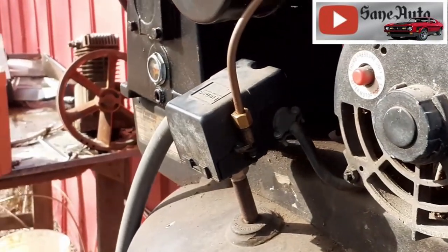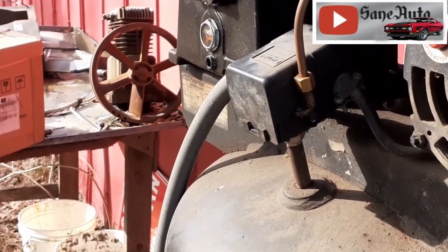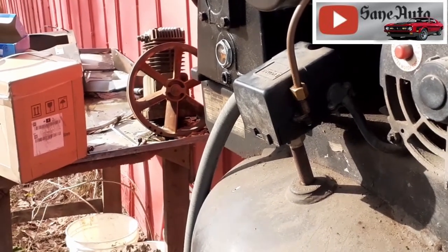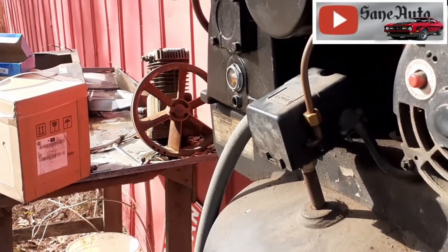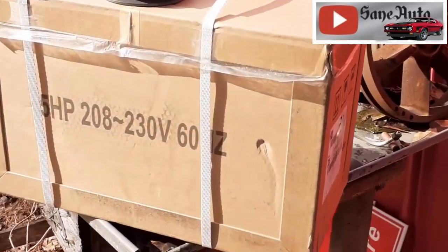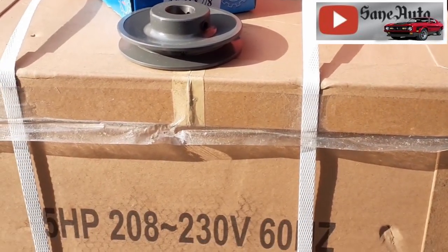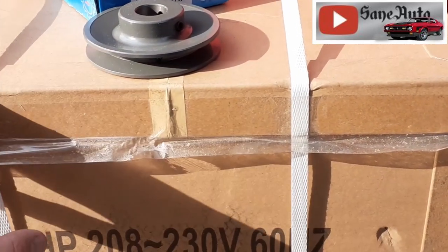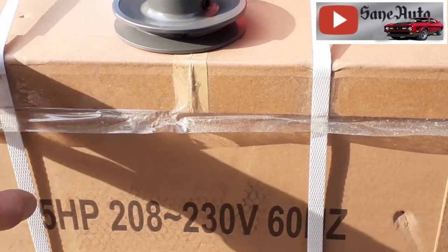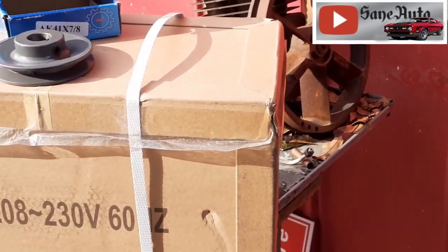You can still follow the link in the description to this motor, and once you get there, if yours is a little bit different than what we're using here, you scroll down on Amazon and it'll show you a bunch of suggestions of similar motors. And that'll give you a head start on your search by just clicking on the link, scroll down, and look at those suggestions. Make sure it says something about compressor duty or compressor motor, because it takes a lot more power and a much heavier duty motor to run an air compressor than most things.